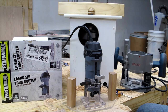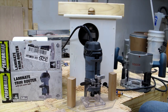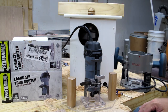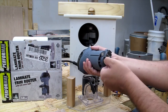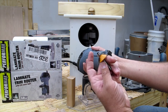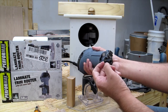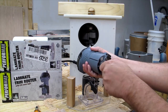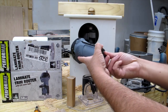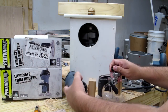Those were two annoyances that a handy person can work around, but the absolute deal breaker is the collet. I was using this on a project with a chamfer bit, only taking maybe a quarter inch of material away, and the bit began extending — it began to come out of the collet. Looking closely, this collet is simply poorly designed. The threads are a bit chunky and it doesn't move up and down easily.